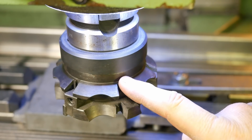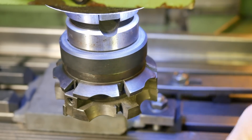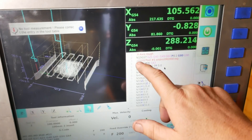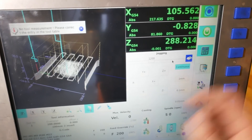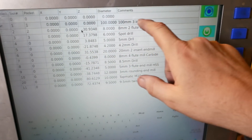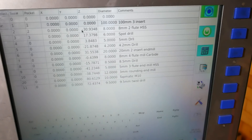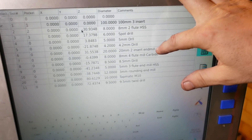That's not going to work because that cutter would go straight across taking out this clamp. So I'll switch out and use just the small 20mm cutter to rough that out. But when I reposted it, I told it to use a 20mm endmill. It's assigned tool number one, endmill 20. But if I look at my tool table, tool number one is my 100mm face mill. The 20mm endmill is tool number six, so I need to change that in my CAM software to tell it the correct location for that.